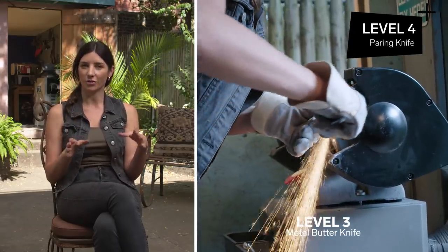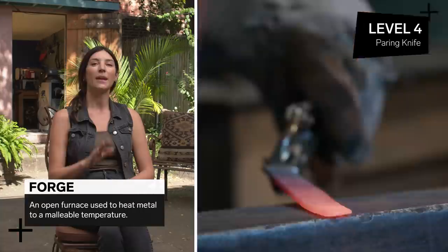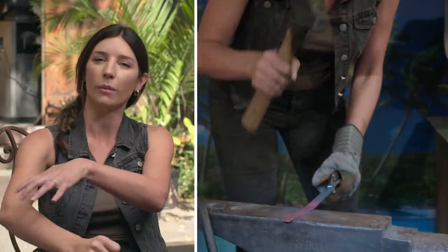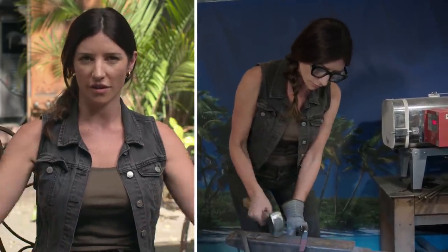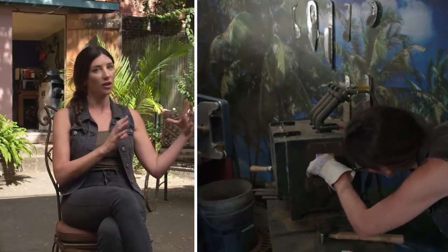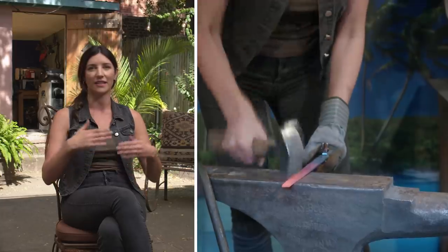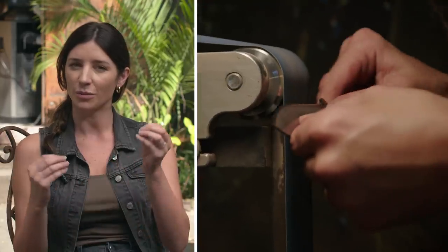As opposed to using the grinding stone to create our shape for the paring knife like we did with the metal butter knife, we're gonna need to remove a lot more material this time. The best process is to heat it in the forge. Forging is a process of heating your material and then hammering it out, spreading the material forward. An important thing to remember when you're hammering: keep your movements really close to the body, so instead of having your arm way out and putting a lot of stress on your back, shoulder, and elbow, keep it really tight. A lot of the techniques require a lot of centered core strength. Be aware that you're working with a very hot piece of metal and machinery that also gets very hot, and as you're hammering, bits of material can fly off in multiple directions, so protect yourself against heat.